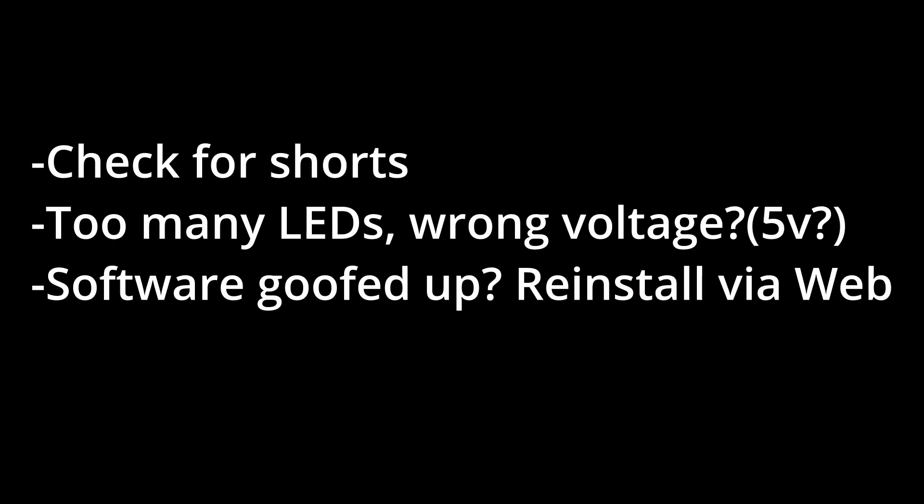For troubleshooting: look for shorts and make sure your connections are okay. If this will get some movement, you may want to solder the connections and consider strain relief - hot glue works, and there are some 3D printed cases I'll link in the description. Also make sure you don't have too many LEDs. Trying to run hundreds of LEDs off this one little unit using USB power will be too much current draw and may fail or actually damage the microcontroller. There are dedicated circuits or hats with protection built in, referenced in my earlier video which I'll also link.